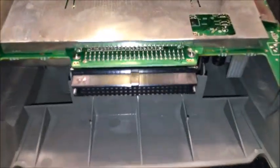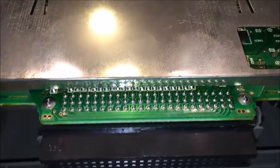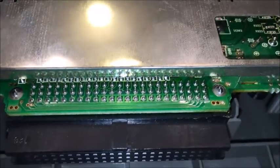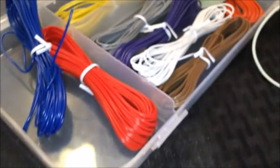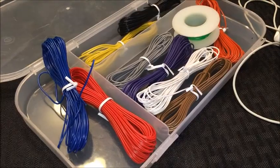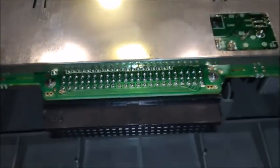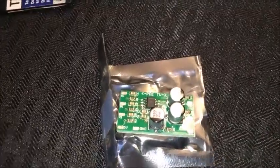I have the motherboard upside down, and here on the expansion port connector is where I'm going to tap the RGB, the 5 volts, and also the ground. So that's all going to come out of that corner here. I'll try to use color-coded wires for the RGB, black for ground, and yellow for plus 5. That way you can get a better idea of where I'm getting it from. And then it's going to go into here — there's the RGB amp.